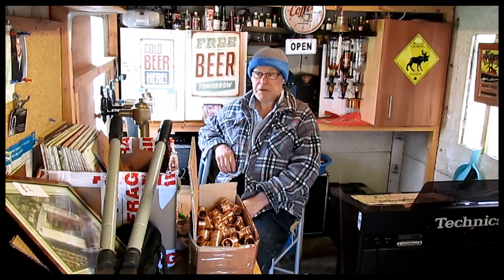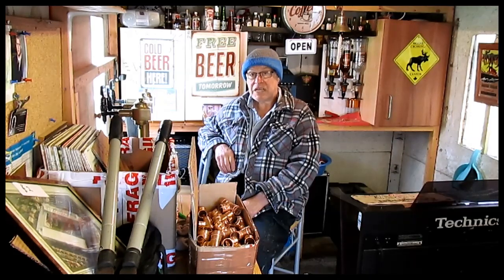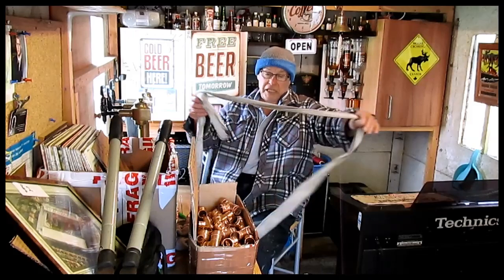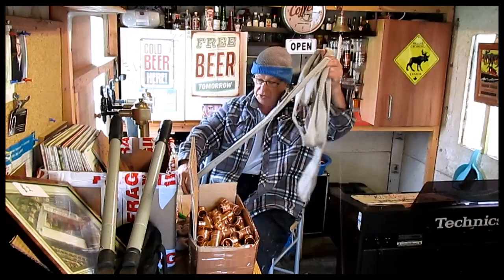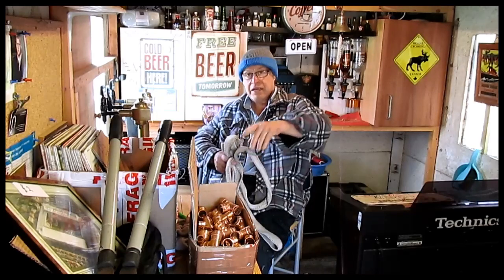I try to keep customers happy as much as I can, but that becomes a ball-ache when you've got to come back and shift something. Plus it's a bloody heavy radiator. It's heavy when they're new, but when you get them full of water it's even heavier. I'm working on my own, so I had to devise a way to lift it. I made do with this sling — two slings put together — so I can put one at either side of the radiator, put it over my shoulder and lift it.